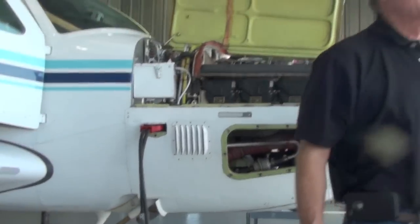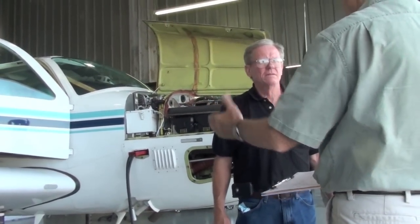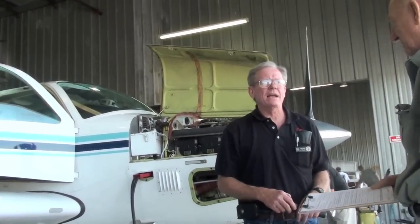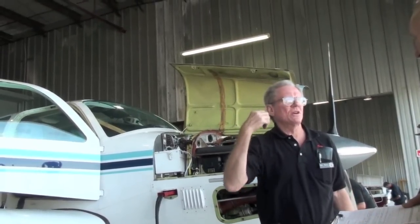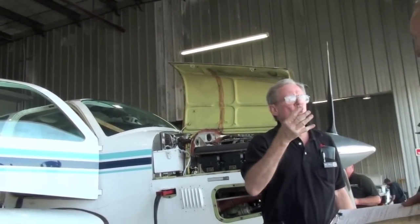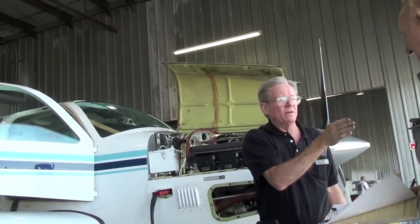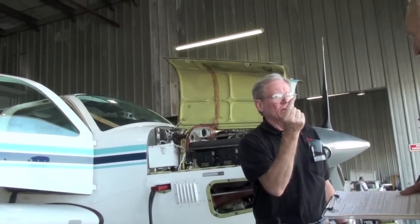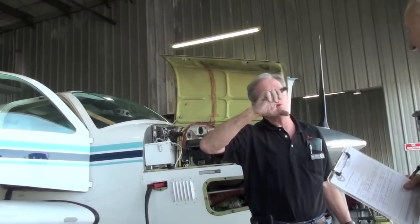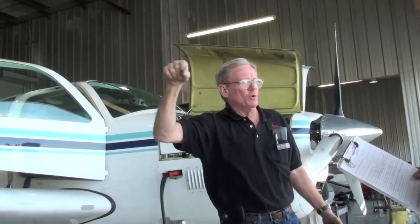On the doors, the ones we were flying, they're all set quite different in cold season. More than likely, what's happening is you have linkage worn on the inside. On inboard doors on a Baron and a Bonanza, there's 4 points to move that one door. You have the outboard hinge point where there's a bearing, then you go to an idler where there's another bearing and a spacer, then you go to the top of the idler, then to another rod that goes to the top of the actuator. And if you get a little bit of wear in each point, it'll do exactly what you're seeing right there.